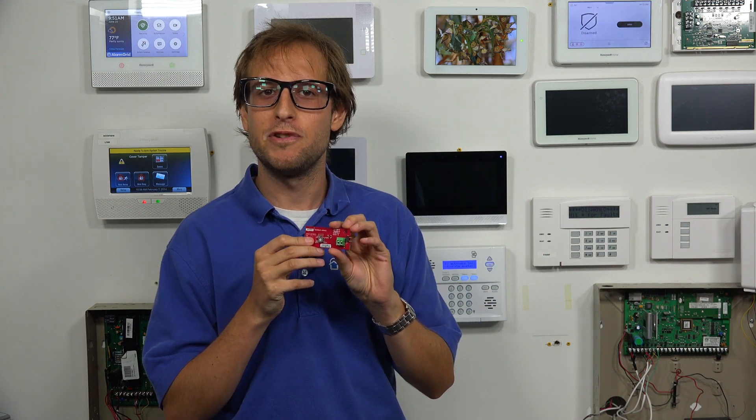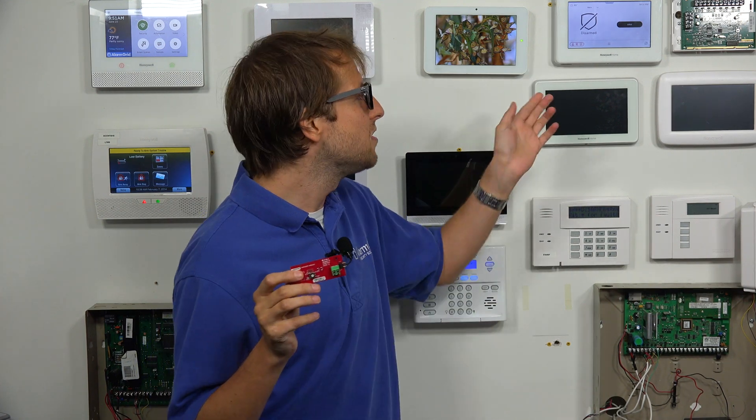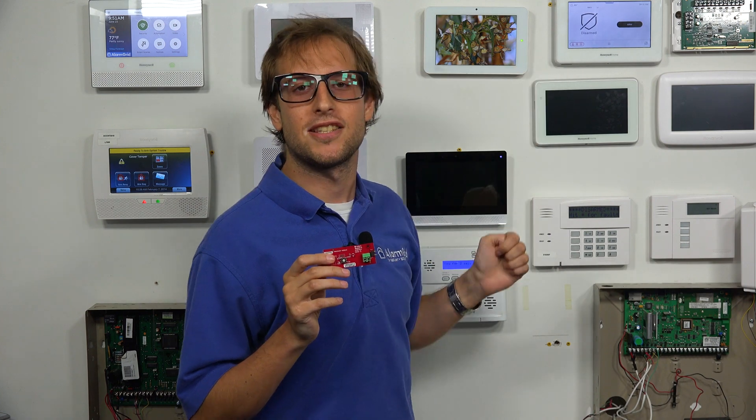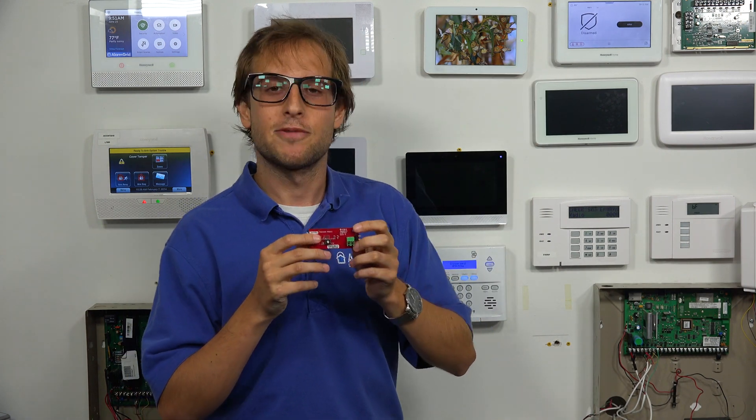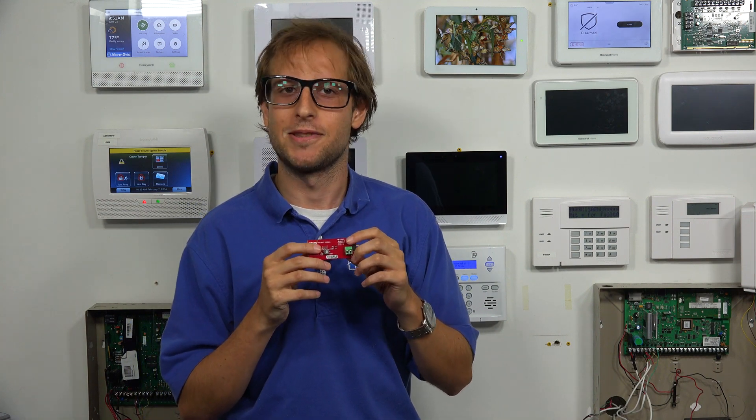The reason you're adding a Pro Takeover module is so that you can use one of five legacy sensor frequencies with your system. You can enroll legacy sensors — not encrypted sensors, older sensors — maybe sensors you have left over from an earlier security system that you want to continue using with your Pro A7 Plus or other Pro Series Alarm Panel. In our case, we're going to be setting it to zero so that we can use Honeywell 5800 sensors with the system.